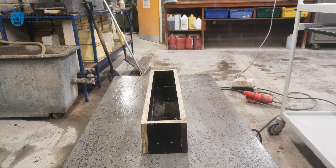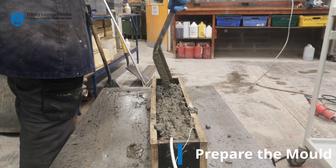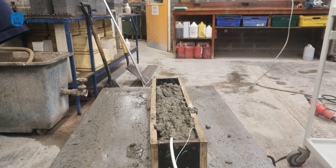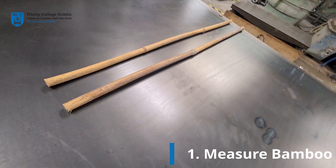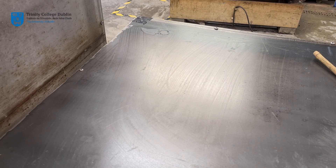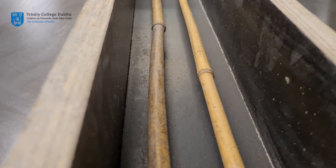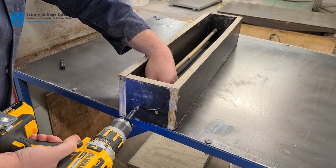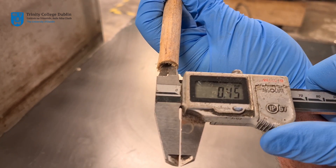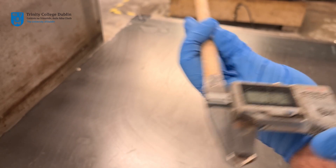In week 10 you will then be ready to start filling the mould. In week 11 the following three preparation steps will first be necessary. Step 1: Measure and record the external diameter of the provided bamboo columns at a number of points using the vernier calipers. The bamboo will have been screwed into the mould prior to your arrival; therefore the internal diameter has been measured and will be given to you. This will allow determination of the wall thickness of the bamboo.